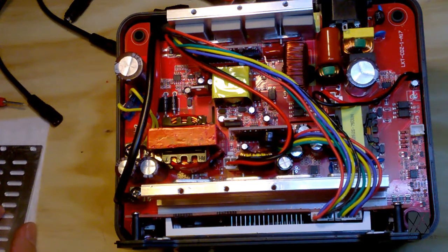The next thing you want to look for is any sign of burning, heat, melting, and you want to look for a black smudge by all the MOSFETs. Now, the MOSFETs are simply electronic switches that can be switched very rapidly, and you can do various things with them. This unit is full of mini MOSFETs. It has quite a few.